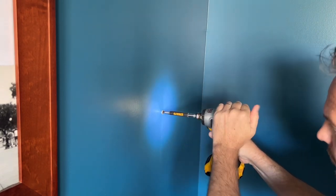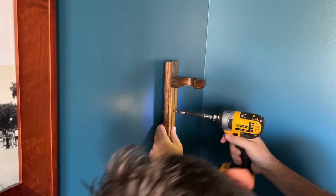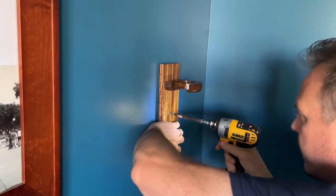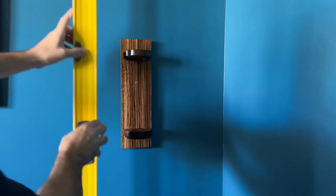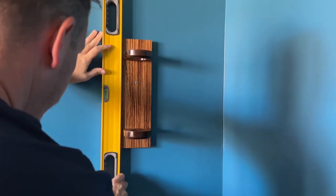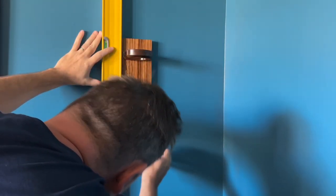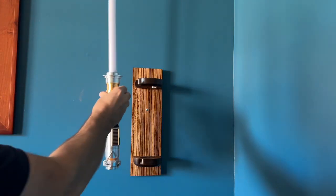Now to simply mount this thing on the wall. I have these really cool metal giant screws that go into drywall — they don't need a stud, especially not for something this light. You run a metal screw into that and you're on. I snug it up, check for level — I was pretty close but I think I bumped it with the level and had to knock it back. Pretty easy to mount this up, and then we get to see how it looks.